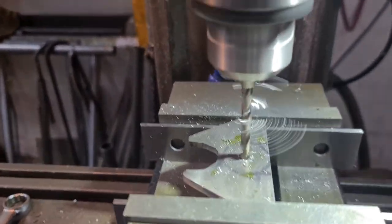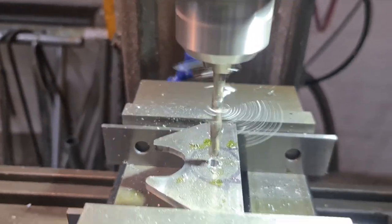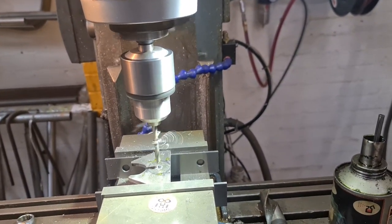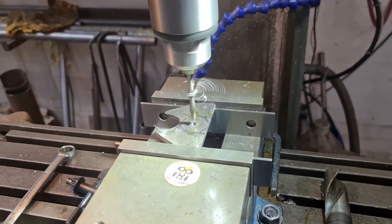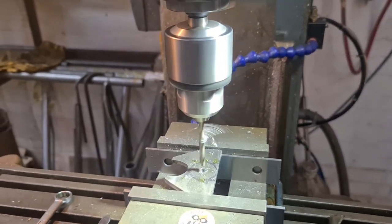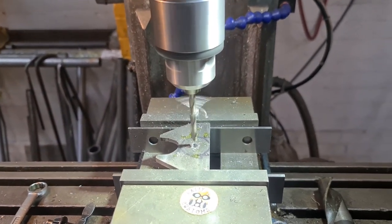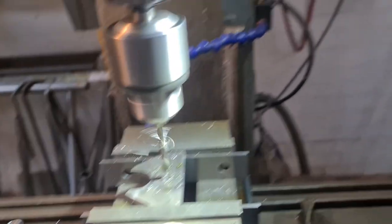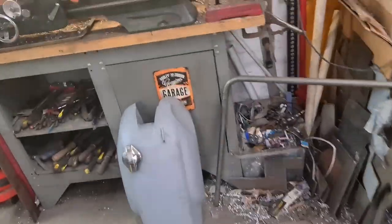And then slow things down and steadily take it out to 1 inch. We might need to do a bit of fettling and filing just to give us a bit more clearance on it, but I don't have an inch and an eighth bit, which is what I could do with, so I think that'll do it. Or I might try an old hole saw, actually. I'm going to have a look over here. If I've got an inch hole saw, I can use that.